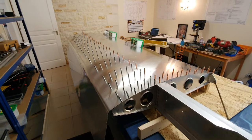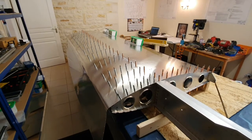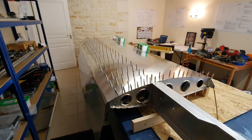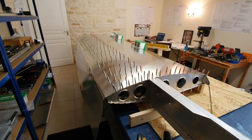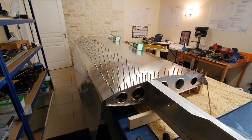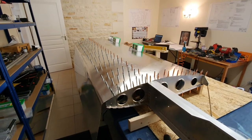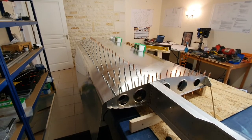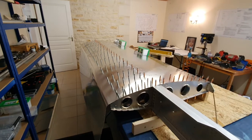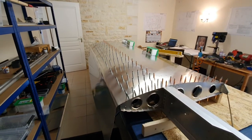On to the forward skin - we've clecoed it back into position on the top side. What I'm about to do now is drill all the holes out to three millimeters, slightly undersized for the rivets, because then we've got to dimple die them - countersink them by bending them, and the same to the ribs - so that we can fit countersink flush rivets, which will be a first for me.